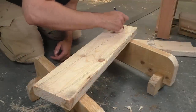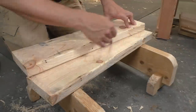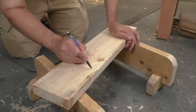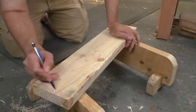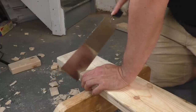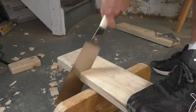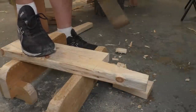I'm just kneeling on a floor mat and I'm totally comfortable. You'll need to draw one straight line for the layout, but one of your leg blanks makes a good straight edge. We're also going to curve the outside of the leg to cut down on tripping — go ahead and draw this curve freehand. It's not hard and you really can't get the shape wrong. Next, we'll saw out that big notch. Kneeling on the board helps me get that crosscut started accurately, and then I can stand up and use both hands for faster and more powerful sawing. Rotating the work 90 degrees sets me up for a fast rip cut, and I'm done.